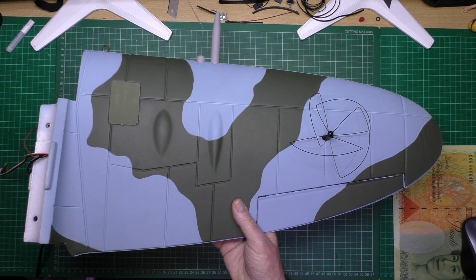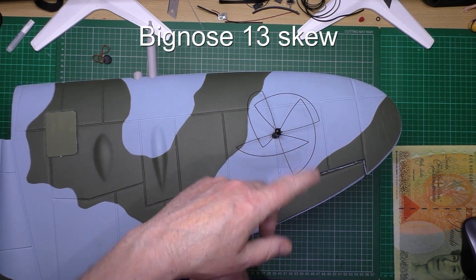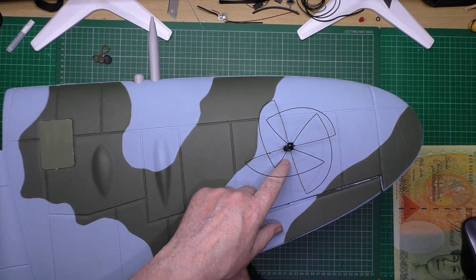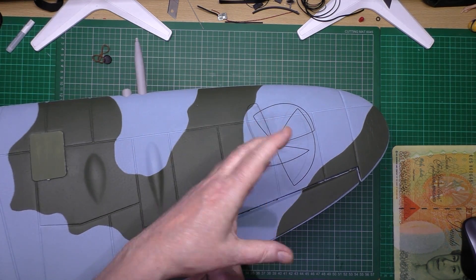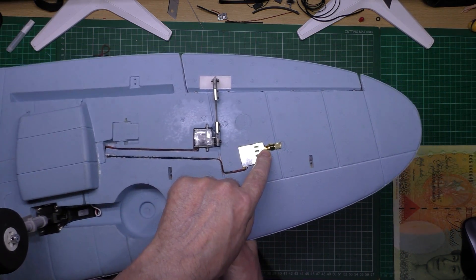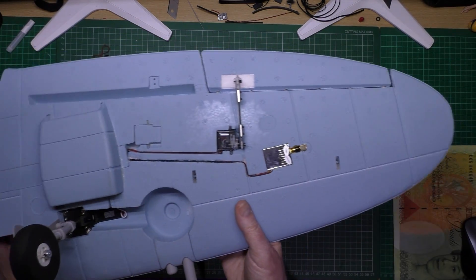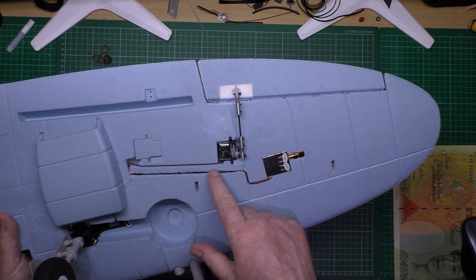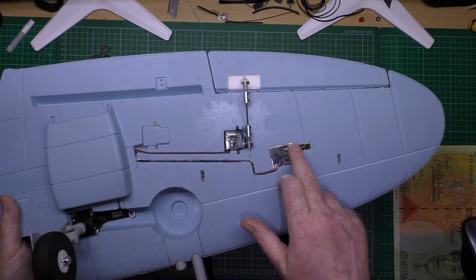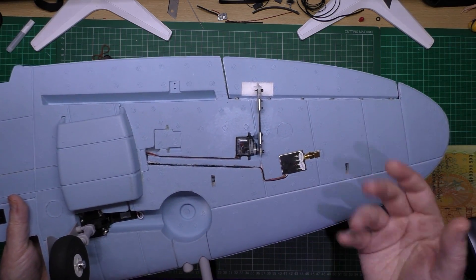In the right hand wing I've got a circularly polarized skew planar antenna — cloverleaf, whatever you want to call it. I may put the dipole in here instead, I'm not sure yet. At 200 milliwatt mounted there, the cabling goes through in the same hole and comes out here. I don't know how to cover this — I don't know whether to put some tape on there or just glue it. I don't really want horrible looking stuff.